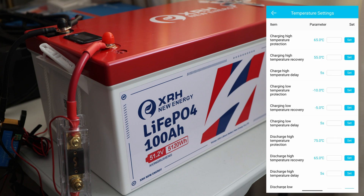I also asked the manufacturer about the low temperature cutoff. They confirmed a charging low temperature protection set at minus 10°C from the factory. Their explanation was that the cells can still charge to 60% at that temperature without damage. The protection temperature can be adjusted if needed, but I'm keeping it at the factory setting for now since I plan to run low-temperature cutoff tests later.